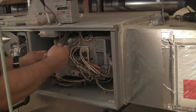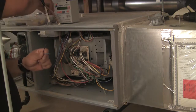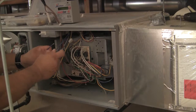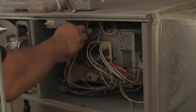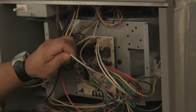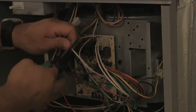Determine which FA wires are to be used and individually cap off unused wires. See the printed instructions for further details involving proper wire selection. Route and dress wiring neatly. We will power the FA with 115 VAC using the black and white leads.